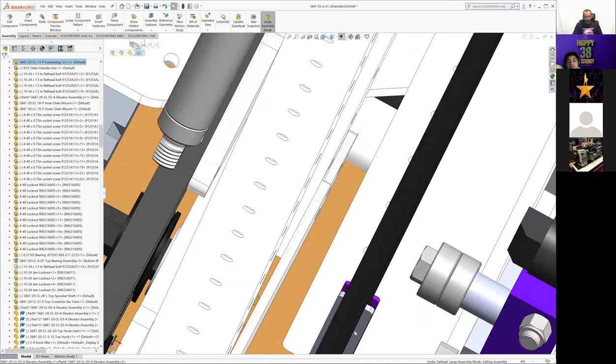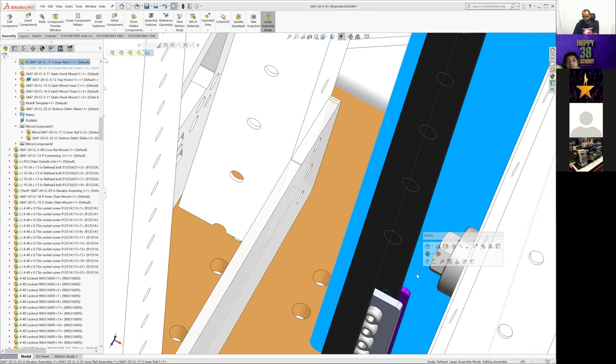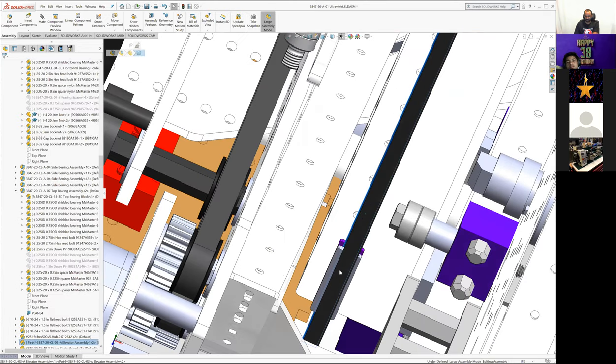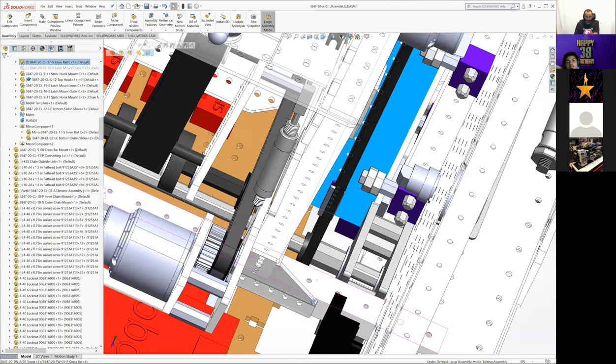Okay, let's see. Yeah, I can kind of show it. So there's bolts going through the chain to here. Instead of last year where everything was sideways and we had these little clamp plates and clamped the whole chain because the whole assembly was running sideways, the chain's running perpendicular to the lift, so it's easier to just put the bolt straight through it and bolt to the sheet metal piece. So that's done on both sides.